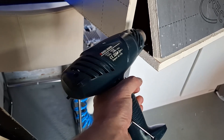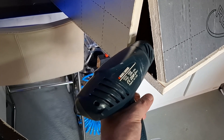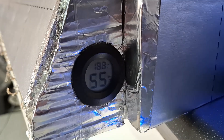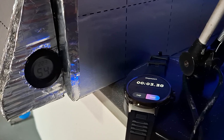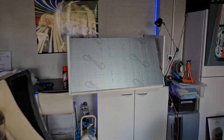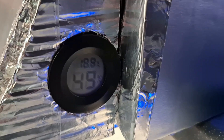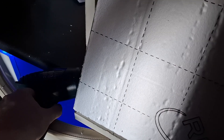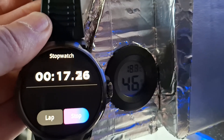How long has that heat gun got to be on full? It's not a particularly warm day — about 16 degrees outside. After maybe 30 seconds of running the heat gun I'm up to about 18 degrees. So time to be a bit more scientific and look at the heat loss coming from the oven. I've precariously balanced a tin of GT85 or something against the other side just to keep it shut. We're down to about 20 degrees after five minutes or so, and down another couple of degrees after just over 10 minutes. So now I'm going to gather some data and produce graphs — that's the joy of being an engineer. Let's do a little bit of nerding out.